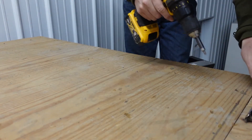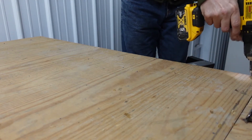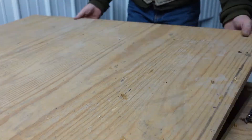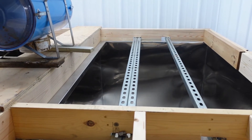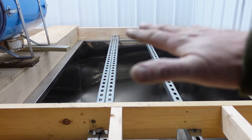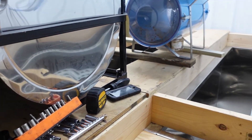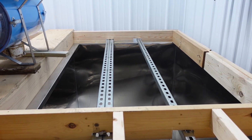We've got to access the underside of this so we can see what we're going to attach to. Next, we've got to remove both of our struts and then measure from this side to that side and cut our 2x6s to go in. Once we do that, we're going to figure out where our 2x6s are going to go based on the distance between these two points here, and then they'll just sit on those 2x6s. I don't know — I might mess that up somehow, so let's see what we've got.